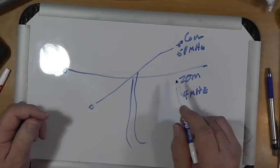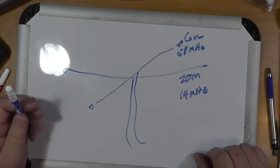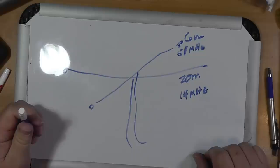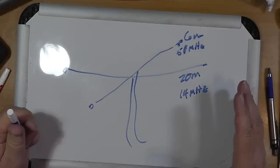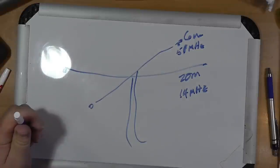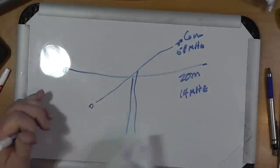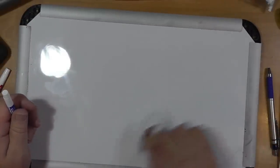If you really positively do not want them to interact, put them at right angles to each other. A 6-meter dipole is not very big — about 3 meters, which is 10 to 11 feet. Not a very big antenna at all. You can stick that almost anywhere. If you're going to do FM work with that antenna, mount it vertically. Otherwise, mount it horizontally. The 20-meter one could be mounted vertically, but normally that would be mounted the other way.